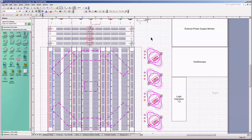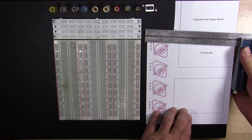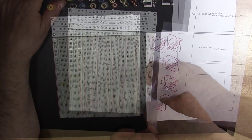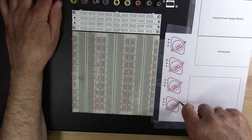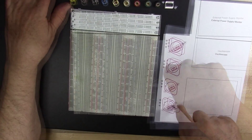Now I'm going to print off that area to the right and use that as a drilling template. I printed off the panel diagram and I'm using a relevant part of it as a center punch template — tape it down. There are quite a number of holes involved that need to be center punched: twelve holes for the feed-throughs, eight for the mounting holes for the transistor sockets, and another twelve holes I'm going to be using to remove material from the rectangular slots.